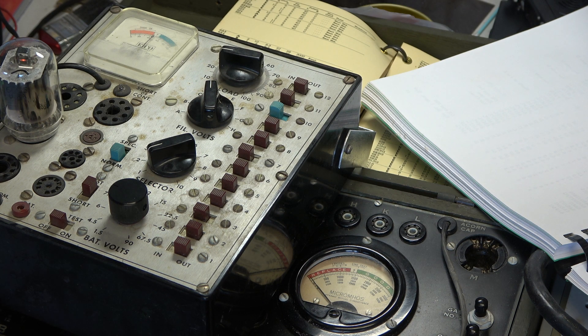We've got the needle on the border there — we know the radio is doing 50 to 80 watts depending where on the band, so it might be sensible to change both of these. I've just swapped over for the other valve and it's exactly the same. It's about the same as the others on the question mark line. So we'll get that little double diode ordered, and a couple of the PA valves ordered. That is testing the valves in the HW12A — although it works fine, there are three valves that are borderline. When we get those we'll go through the alignment and finish off the job. Thank you for watching.